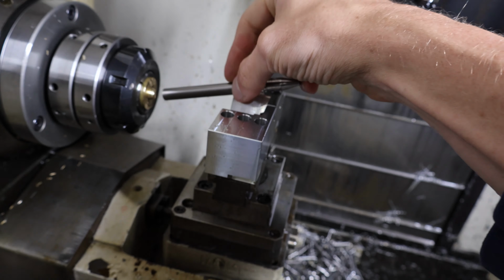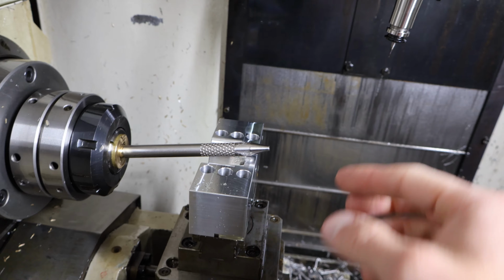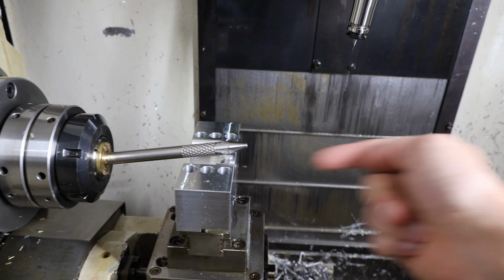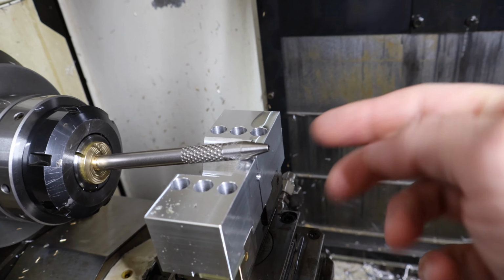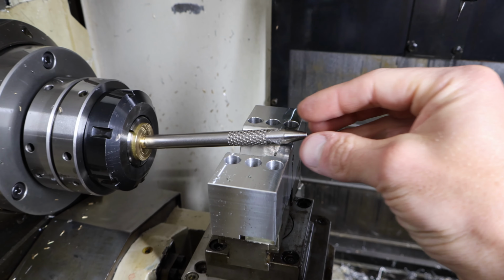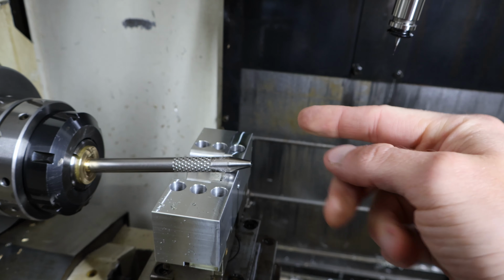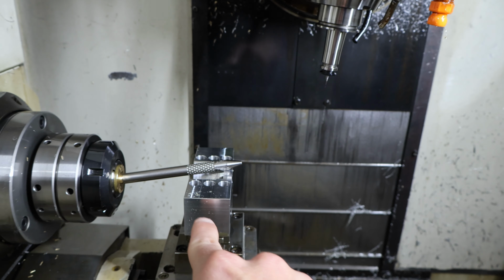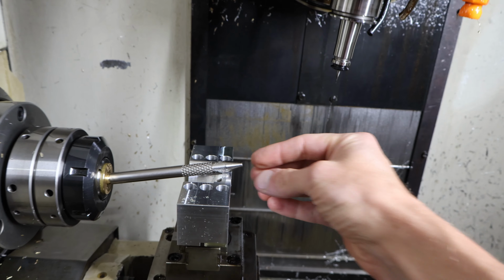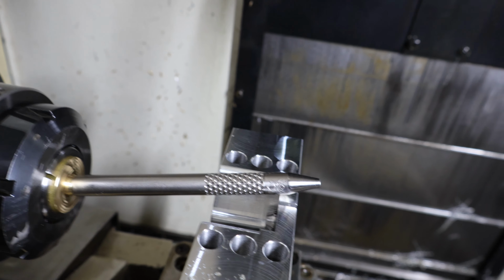If I take this pen apart, take everything out, now I have a tube and a tip. And I want to hold that. This setup is not going to work. I would need vice jaws that come out far enough this way and can hold it either in the center there, because there is a chamfer in there, although I think it's a 140 degree spot drill chamfer, or I can make a reverse cone that cups the tip as a rotating live center again, and then pinch it there, and that's probably the way to do it. So I could make some vice jaws that extend, come out, and have the same bearing, but with a cuppy thing right there. And that is the way to do the tip of the tube combined.